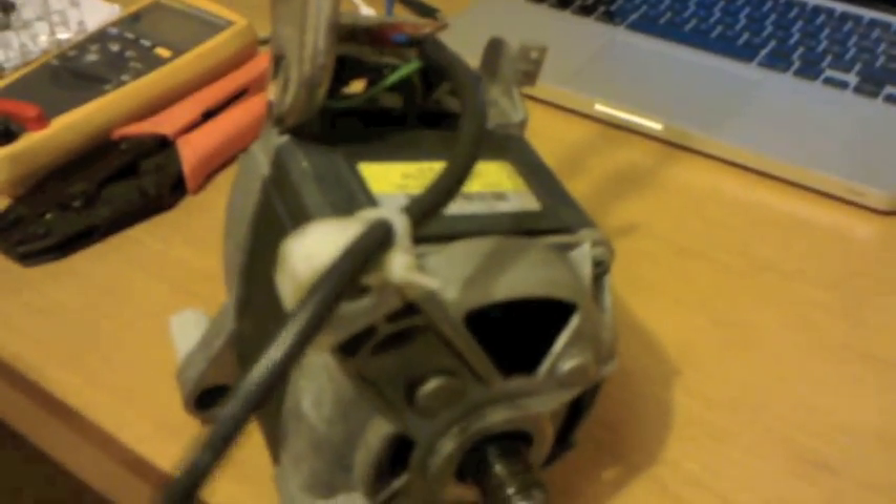After we have our terminals all on and we've made sure that they're not touching, it's a good idea to use insulated crimp plugs to make sure that they can't touch each other. We attach our earth, and I'm going to use vice grips here just to make sure that the cable is firmly attached and it's not going to short out. I've also cable tied the cable itself onto the edge of the motor to make sure that when it starts vibrating it doesn't pull off and short out any of the terminals.